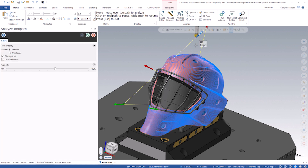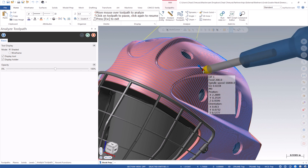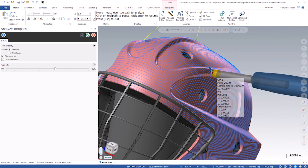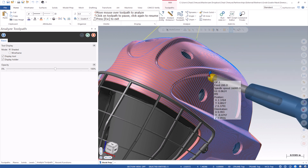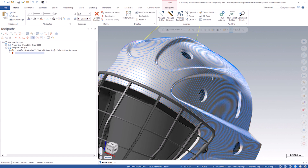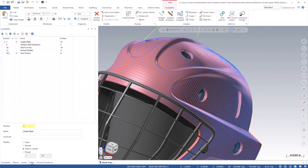If we look at the screen here, this is me putting a unified toolpath directly onto the finished part. If I run an analyze toolpath on this, you can see there's a lot of tool motion — I don't need to be doing all this crazy tilting, because in this case the tool is just trying to stay normal to the drive surface.